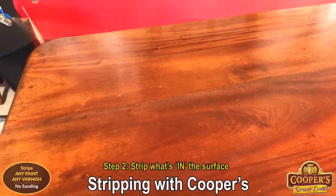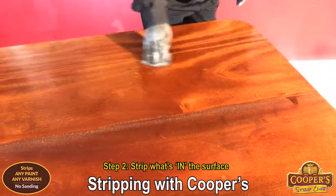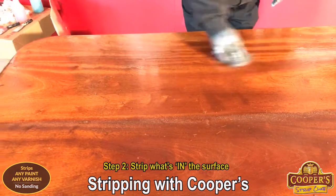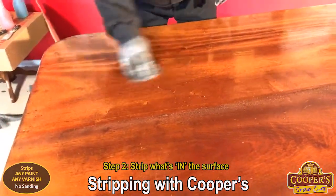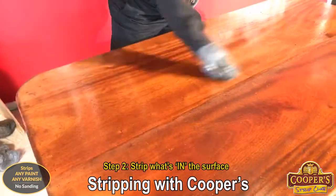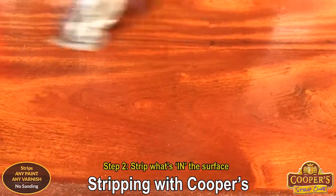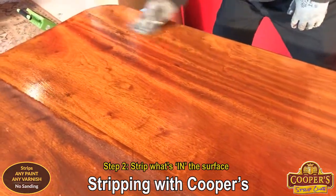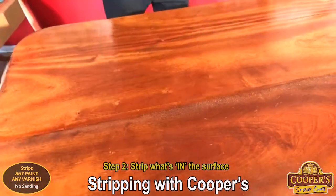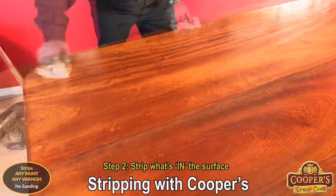So it's all good and wet still on the top — it hasn't dried out, so for the last five minutes it's been soaking in. This is part two: stripper on. It says leave it a couple of minutes, but I've left it longer — it doesn't matter, the stripper isn't going to hurt it. And we just wet scrub with the wool and all the varnish, all the lacquer that's deep in the grain is all coming to the surface. If you've got a nice wet layer of mushy stripper there, then wipe it off first because that will reduce the amount of flusher that you'll use.